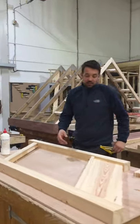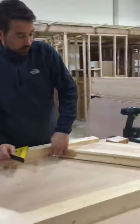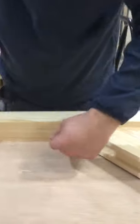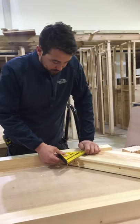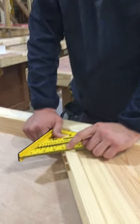So what I did first is I attached the base rail here. The hand rail and the base rail have got to be centre of the newel. Now for these angled cuts — this might come up in your EPA — I had to get the pitch of the staircase, and the pitch of this staircase here is 37 degrees.